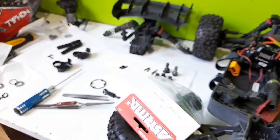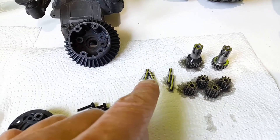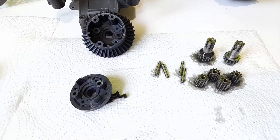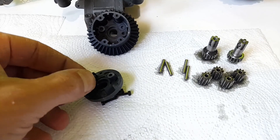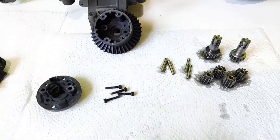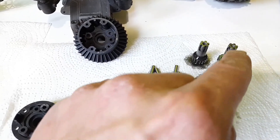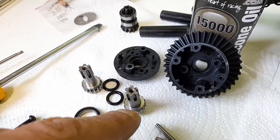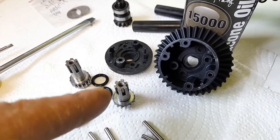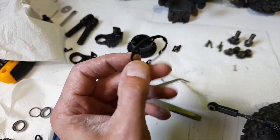So we're going to do the metal on the plastic again. As a quick note: if anyone is taking one of these apart and you're a little worried about where everything goes — these pins are all the same size, these gears are all the same inside. Make sure to seat your o-rings in there, or you're going to end up having a hell of a leak. The o-ring sits in there, one sits in there. Locate one down in there first, put the pins in, locate the gears in, and then seat the next one down. Don't forget the gears have got a little washer — a little shim — so don't forget those. When you're taking it all apart, just make sure you're collecting all the parts as they come out, and they just go back in. It's that easy.